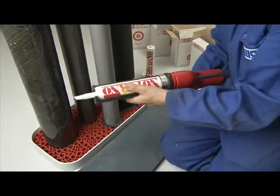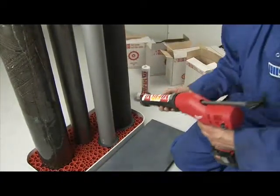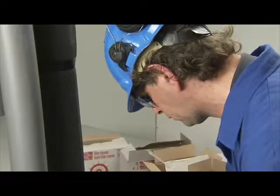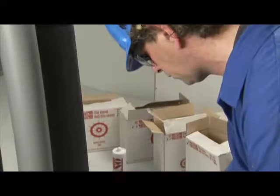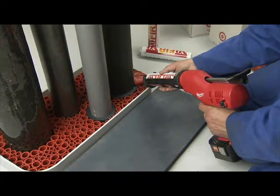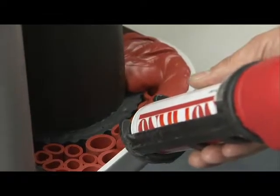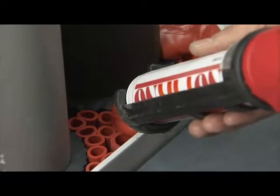Start by filling the 20mm free space in front of the penetration with Noferno sealant. The conduit should be overfilled with the sealant, because some Noferno sealant will be pushed between and into the empty filler sleeves during further finishing.